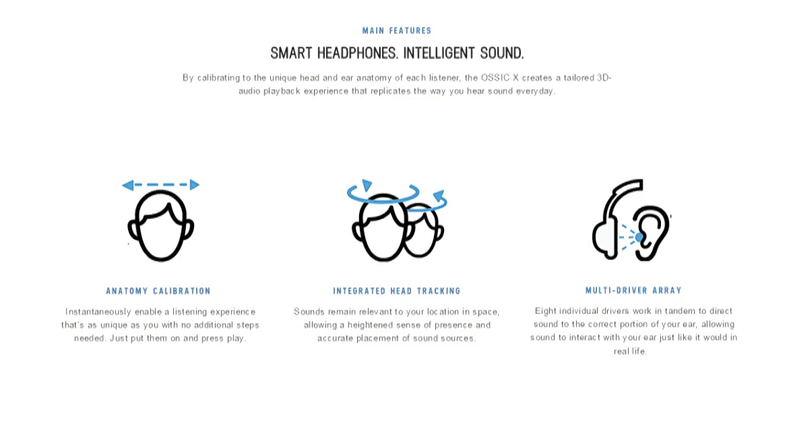The other really important thing, which is not given that much importance in general, is the head tracking. Head tracking is one of the most important things in actually binaural listening. The tiny head movements that we do all the time while listening to sounds make a huge difference. Imagine a sound source right at the center — you don't have ILDs and ITDs, it's all zero. If there is a mismatch between the spectral cues and your HRTF, what happens is we often do these tiny head movements. Even a tiny head movement — I would exactly know that the sound source is on the left side of my head and I could pick up the angle. So tiny head movements are very, very important to localize sounds.